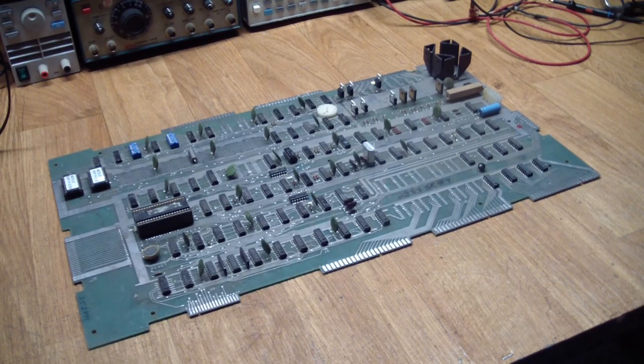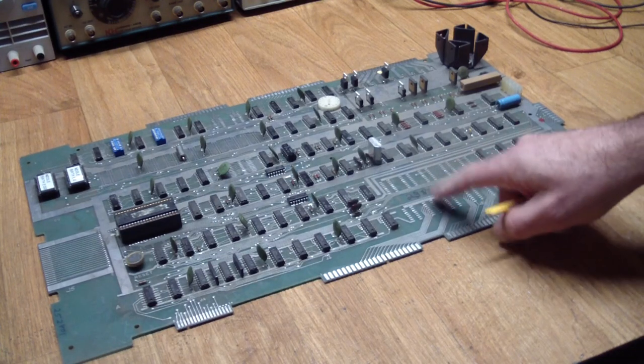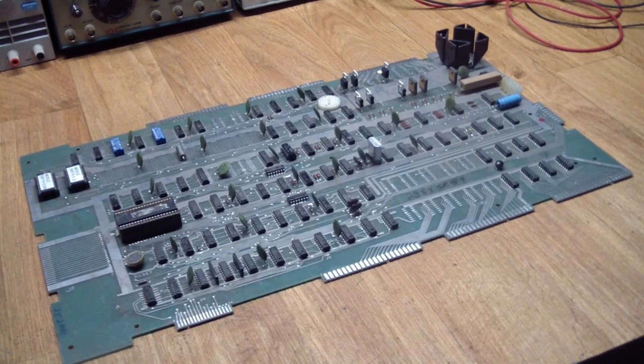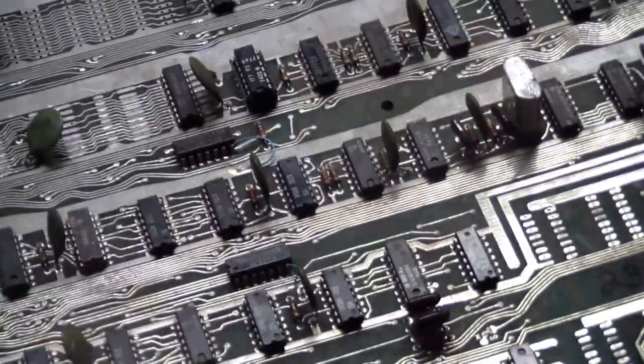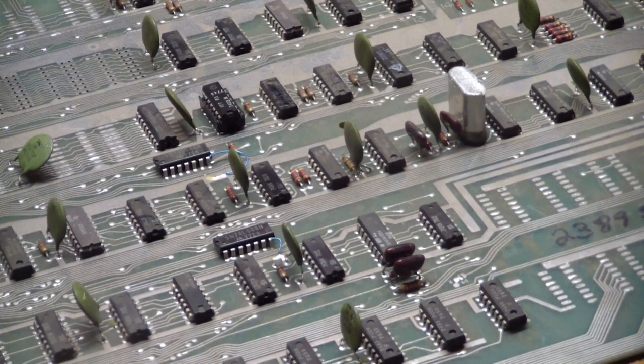I welcome your comments on that issue. You may remember that along with the pinball machines I got, I got 21 of these boards thrown into the deal. I did a first pass, basically just plugging them into a machine, and at first none of the 21 boards worked. Some issues became obvious just looking at them. One thing I found interesting was the crystal over here — it's a ceramic crystal and it's banged up pretty good on top. It sticks out more than a lot of other stuff, and on about three or four boards the crystal was gone, broken off from the board.